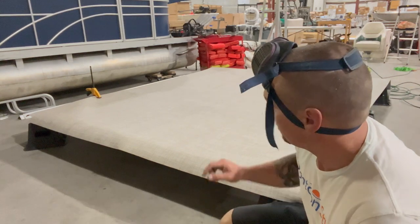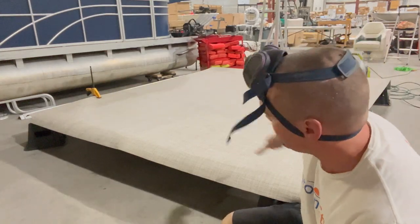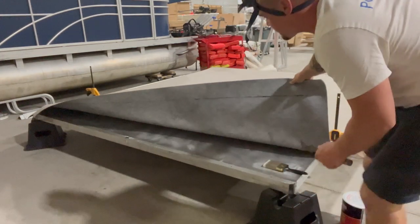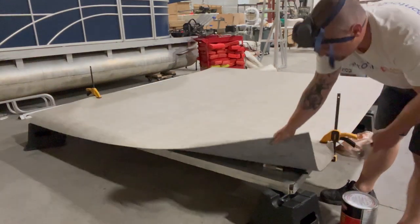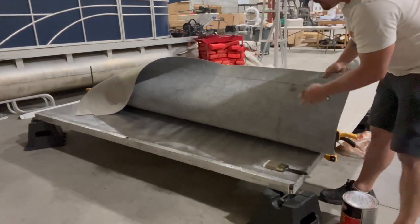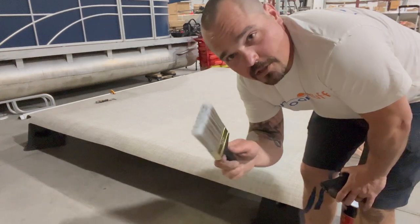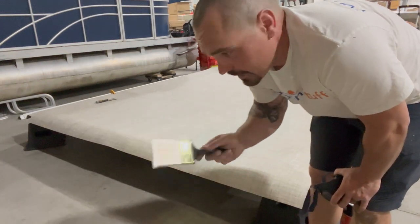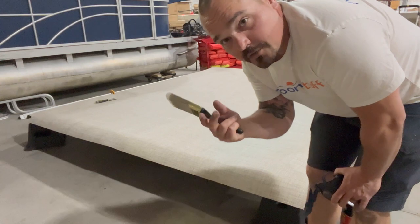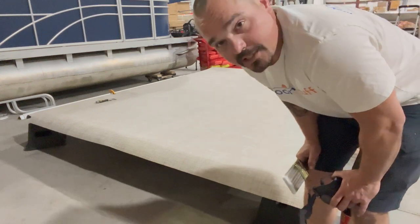It's a good look. So what we're going to do is - as you can see we've got clamps - we're going to roll this back, put the adhesive on the aluminum about a foot or 16 inches worth, and do the same thing. I've marked on the bottom of this where it's going to line up at the edge. So I can do about 16 inches of glue down the vinyl, let them tack up, and stick them together. You could use a paint roller, but I've had good luck with the paintbrush because I can really work it back and forth and get rid of any thick spots. If you get too thick on there with too much solvent, it takes a really long time to evaporate and you miss that whole timing of the solvent-based adhesive.